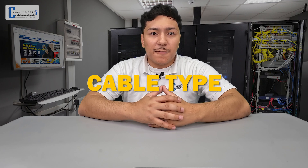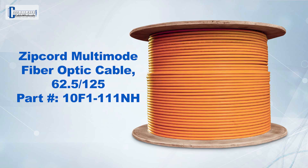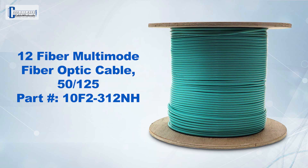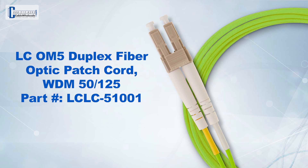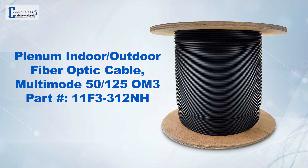Let's dive into the cable type. When dealing with indoor cable, the color of the jacket will tell you a lot about the cable inside. Single-mode fiber will have a yellow jacket, and on the multi-mode side of things, we'll find some different jacket colors. OM1 and OM2 cables will have an orange jacket, while OM3 and OM4 cables will have an aqua color jacket. OM5, or laser optimized cable as it is usually referred to, will have a lime green jacket. If you're dealing with an outdoor or indoor/outdoor cable, typically the jacket will be black.